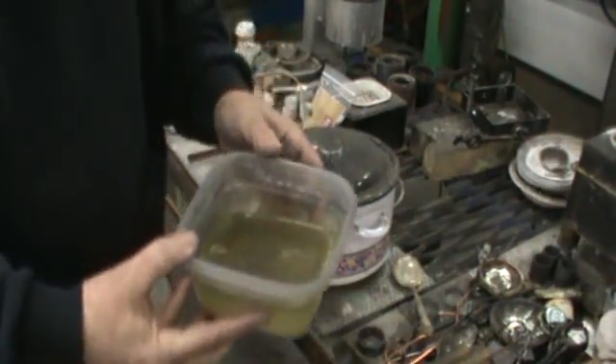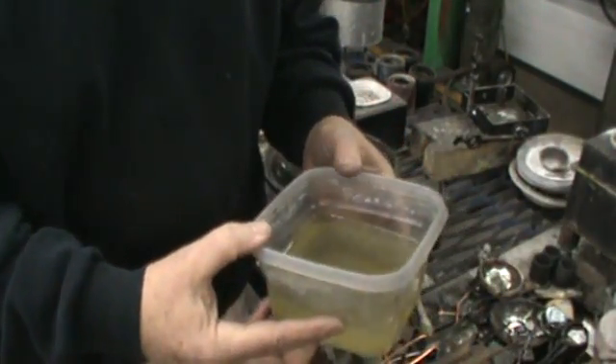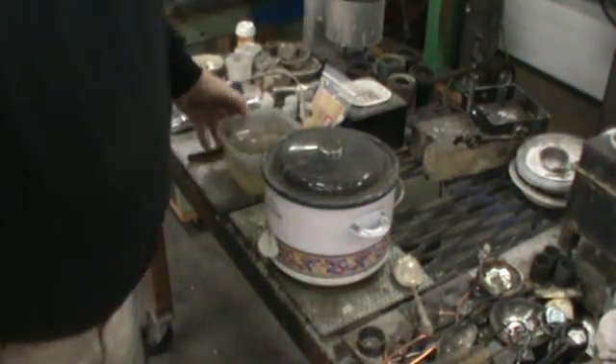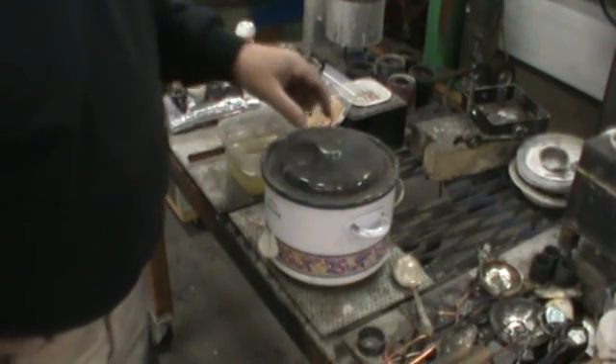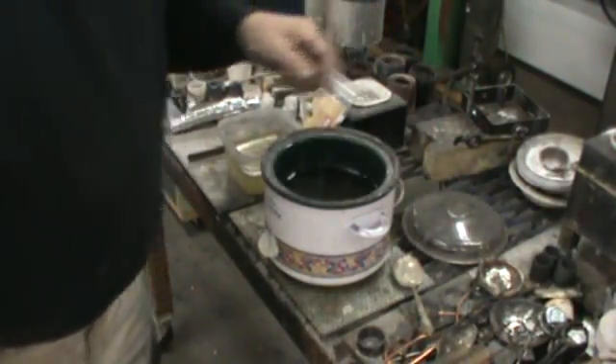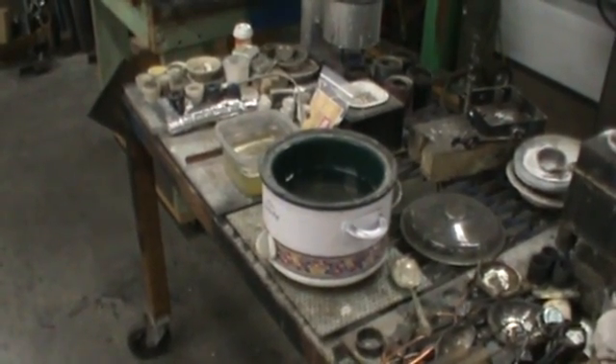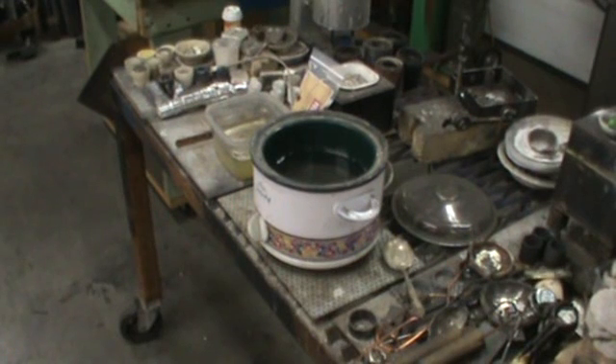This should look like clear water. What happened is I contaminated my pickle pot the other day making a furnace. The grinding coming off my grinder got on top of the pickle pot, and when I took the lid off, all of this buildup fell in. What I ended up with is crap — it should be a clear liquid in there, but it's separated crystals out. I ruined my pickle solution.